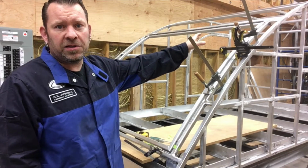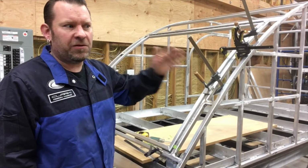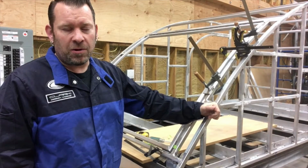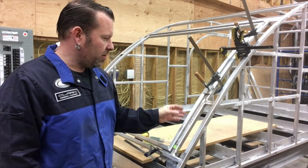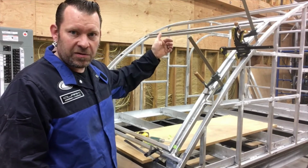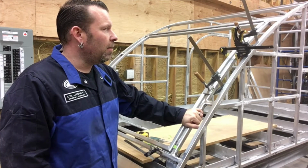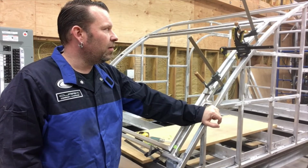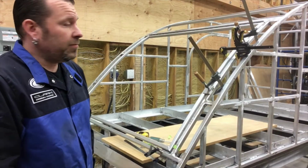I went with that style hinge, a piano hinge, because the hurricane hinges never shut in the same place twice because they're sliding, and your hinge has to overlap your body to not get water in it. I don't like the look of it, and I'm doing a bit different. So this style is what I choose to do. I'm going to do that piano hinge, and that's going to have a cover that goes over the piano hinge. It's not my favorite look, but I still like it looking better than something sticking out of the side. And this will be much better for water. So this is what I'm doing. I'm doing a piano hinge style.